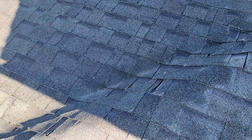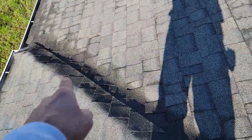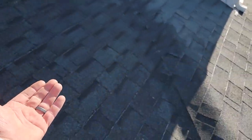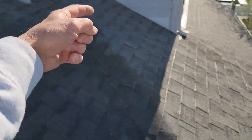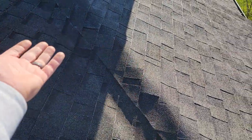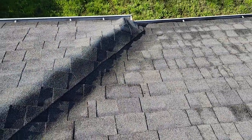Right here I just see some waviness, and then I see this hip. In all my years of roofing, you've got to admire the attempt at the craftsmanship for this multiple-layer roof over and how they did their hip. They ran the underlying side, brought the other side over, cracked the line out of the valley, and made a hip with a roof — I don't know what you call it, but it's unique. I've never seen that before.